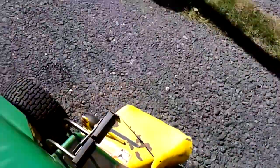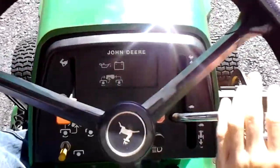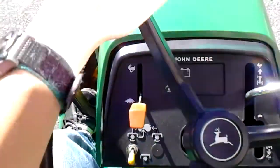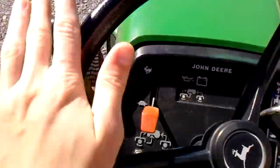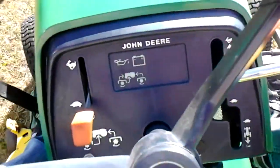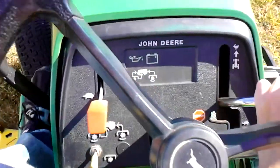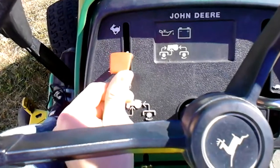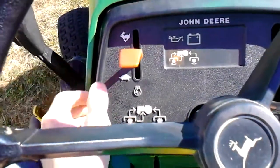Alright, it's been a couple of minutes, so we're just going to get back on and go over there. We're going to take our good old time to get over there. This thing picks up the sound a lot better. Here is the power of the tractor. Now it's at idle. With this tractor you have to give it about half throttle, then let the clutch out and slowly work it up.